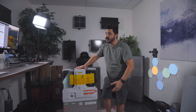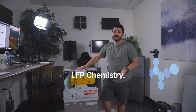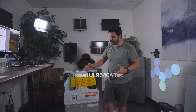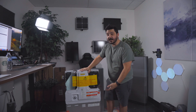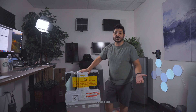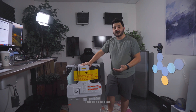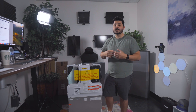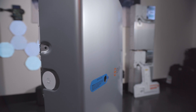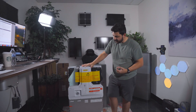They're also using lithium iron phosphate, which is one of the best chemistries for residential batteries because it's the safest you can really get on your home. It is UL 9540A certified, so it has passed the large-scale fire test. That means these batteries can be installed up to three inches apart, and if something did happen — say someone shot at this thing — it's not going to catch on fire or catch your house on fire because it doesn't ignite and it doesn't propagate any fires. I hope jurisdictions pay attention to UL 9540A because it's a really important certification for all batteries.